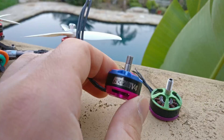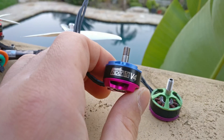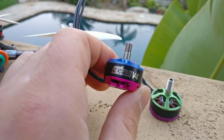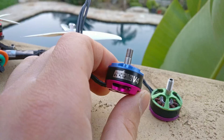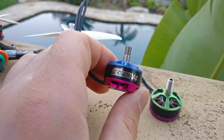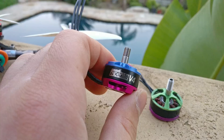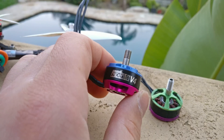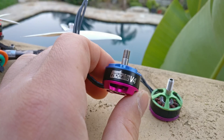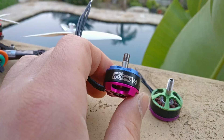The next part is the actual magnets themselves. We go by the numbers of these magnets — N42SH, N52, and various others. The higher the number is supposed to indicate higher magnetic properties. I don't know if N52 is actually being used — I don't think anybody really does know. But for the most part, stronger magnets are better, and stronger thinner magnets are better — we'll discuss why later on.